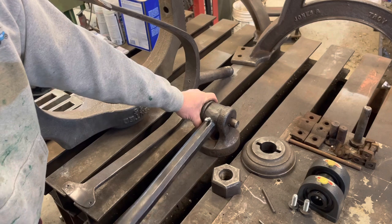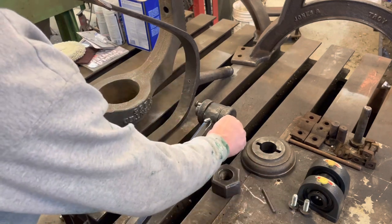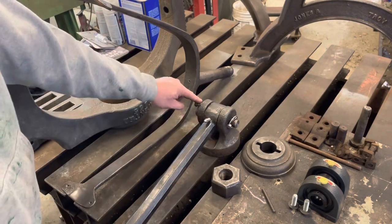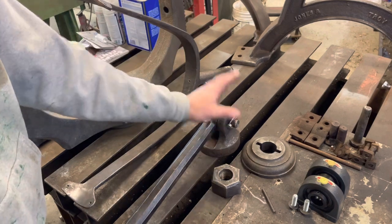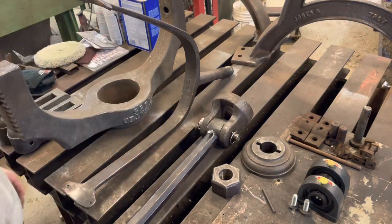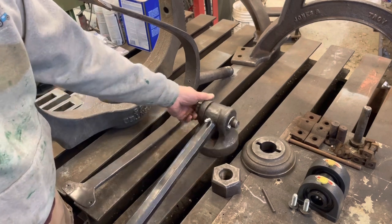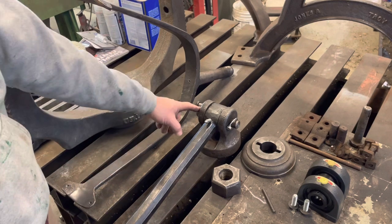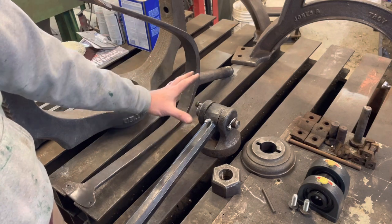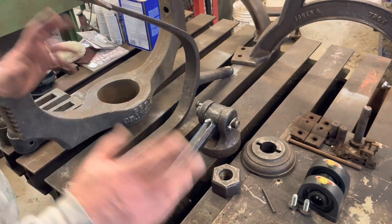So the pin has to stay stationary; the clapper swings on the pin right where it's greased and has a bronze bushing. That is perfect. And then as a double backup — because it ain't built until it's overbuilt — I also put a pin through, so that if this thing should break, which can't ever happen, the pin can't fall out. I hate to re-engineer something these guys knew what they were doing, but I look at heavy equipment — they always lock the pin and limit the joints that are moving on the pin. That way, worst case scenario, you wear out the bushing in the one piece that moves, and that's it.